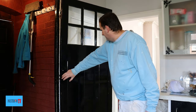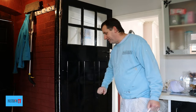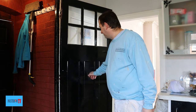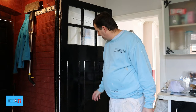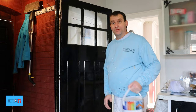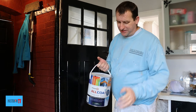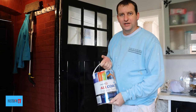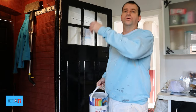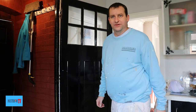So like I say, I'm going to sand all of it except for the middle panel, and then in 30 days time we do a little scratch test to see how well the unsanded area performed. As time goes by, we will do it on UPVC, and we'll show it going over bare wood. But for now, we can't do all of those, so we can do it and see how it goes over glossy surfaces.